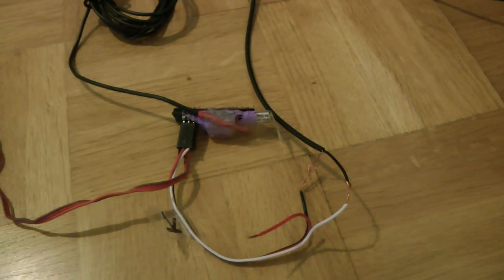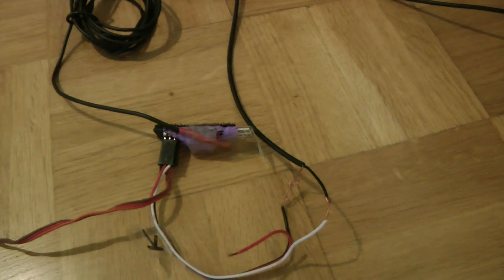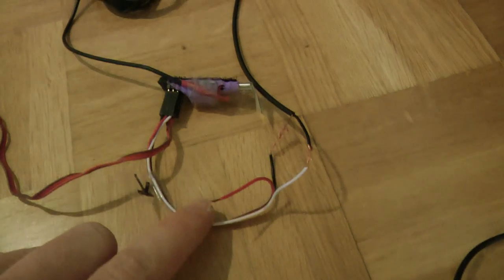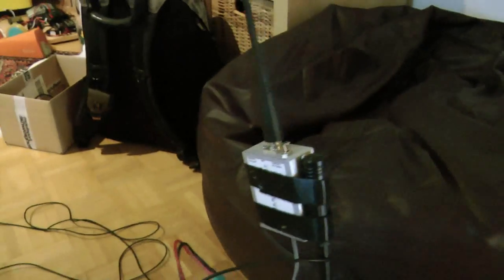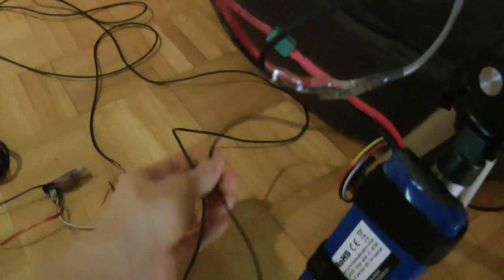Going over to this little AC-T four-channel receiver, which is used on microcopters because it has a PPM out — a sum signal out option. The sum signal goes on port 4 here, signal and ground to the long wire which is connected to my Xeara box here on this tripod. The Xeara box takes the long black cable from the 35 MHz receiver as PPM in.